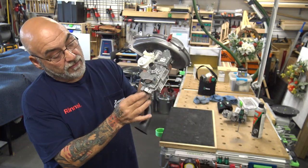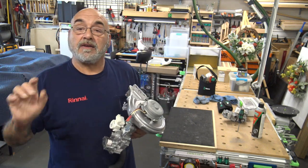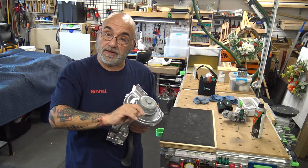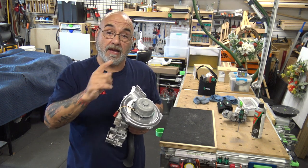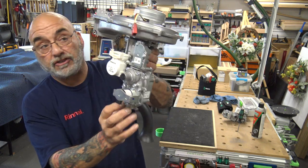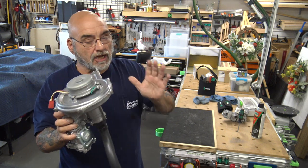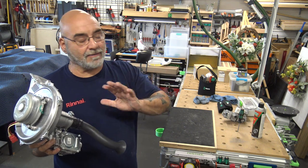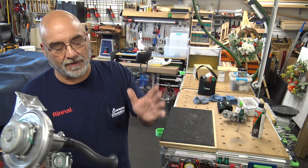And then you're going to need to remove the gas valve. It's a bent stainless steel tube. Now, again, before you do anything, you're going to need to shut the power off and shut the gas off, all right? You don't need to shut the water. Shut the power, shut the gas. So then you're going to remove the gas screw and those three screws, and then you're going to manipulate this out, and it does come out. It appears that it doesn't, but it's going to come out. Once you take the first one or two of them out, you'll be fine.